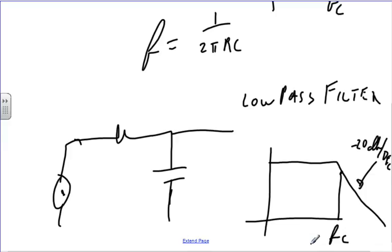And we did the same thing with an inductor, getting low pass and high pass filters, and then we put them together, inductors and capacitors, and had notch filters, or band pass filters. But in all cases, the amplification we could get out of this thing, we'd never get anything other than one or less than one. So I've got a resistor, and I'm going to lose some of the voltage across the resistor. I'm going to have 0.9 of the signal coming across at the maximum.